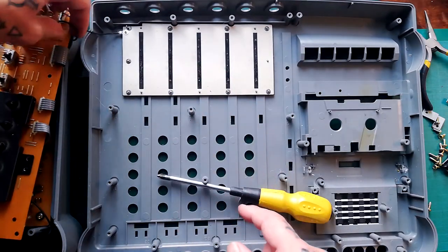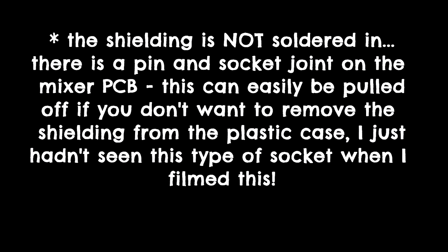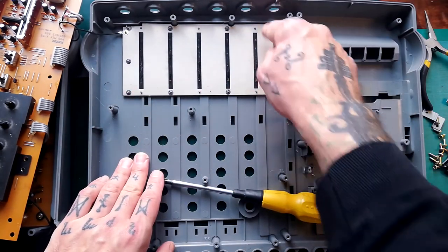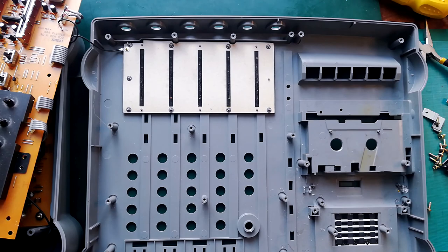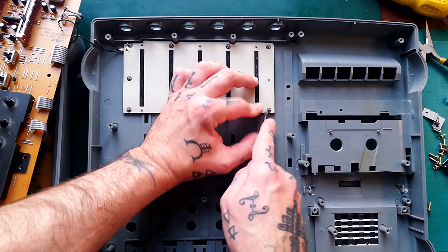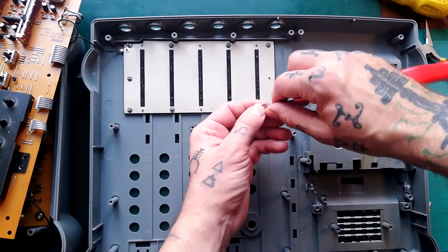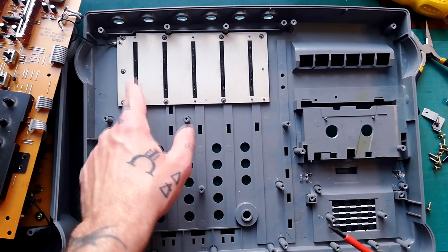This earth shielding is soldered into the board here — it doesn't just easily lift out. We've got these clips: about eight of them. Those clips are somewhat familiar to me; they're the clips that hold the Tascam logo onto a 244. I wonder if we can just pry these up — yes, they do just come off with a flathead screwdriver. That's a bit of a pain. I'll do the rest off screen and come back when that's off.